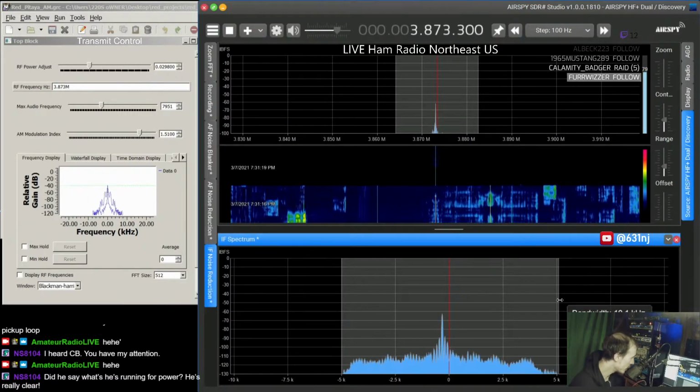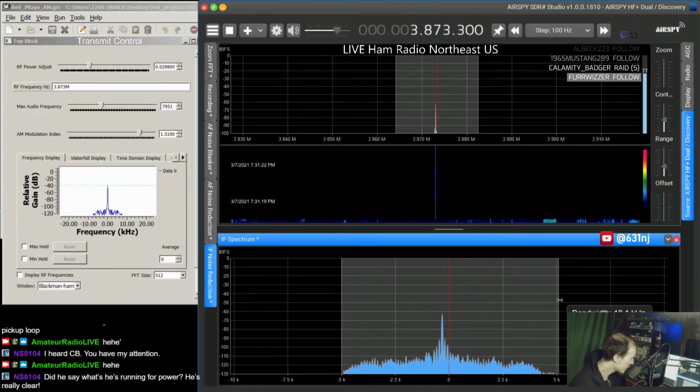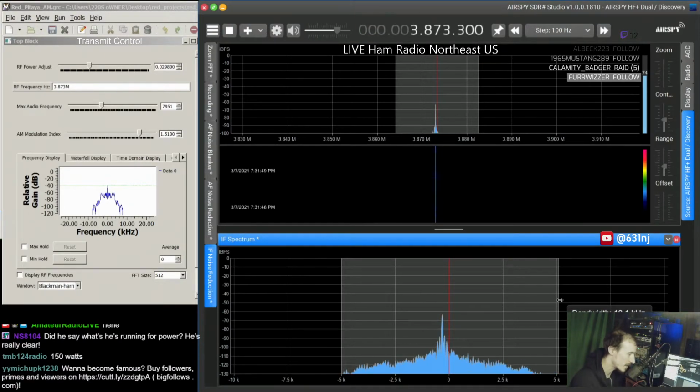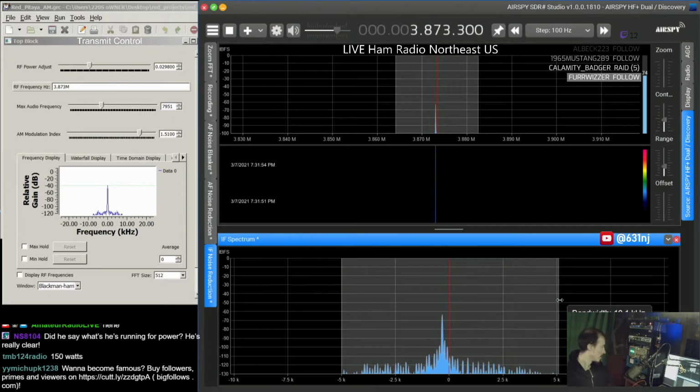Yeah, I wouldn't drive that any harder. If you got 150 watts carrier, like 800 peak or so, that's just about right. I think if you want to go up in power, I would stick another amplifier behind that, turn it way down to drive it, then you'll have nice headroom. Turn everything down, just get a big amp to be the last thing before the antenna. But I don't know if I would push that 811 any harder. I think you've got it actually pretty much topped out. W2BTK.